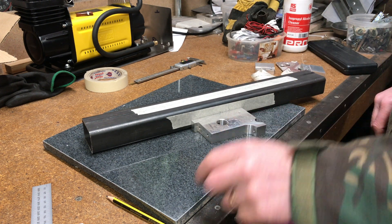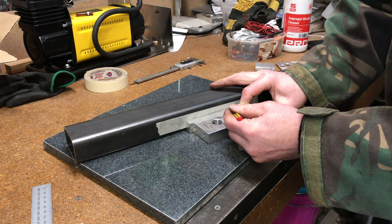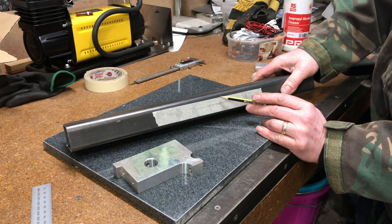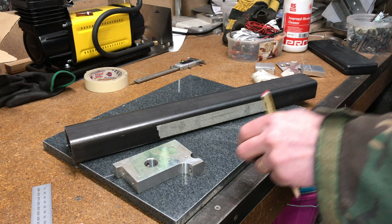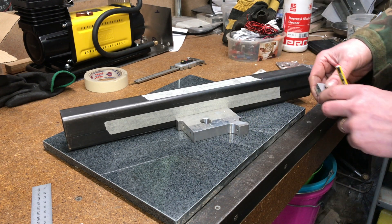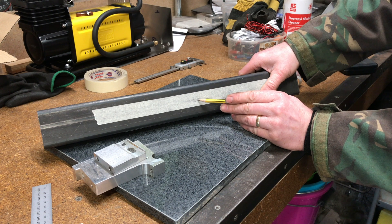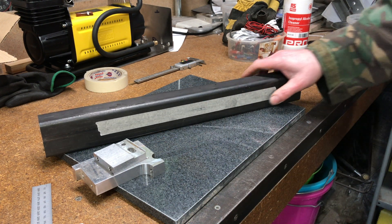The best method I found is to use a similar-height piece of metal, draw a line, turn the tube over, draw another line — you end up with two parallel lines and divide the distance between them, which gives you the center. That's fine, though not very accurate. I work to two millimeters in the workshop, not fractions of millimeters. But if you've got a bigger distance to measure, you need spacer pieces, and if they're not the right size the accuracy becomes even less reliable.